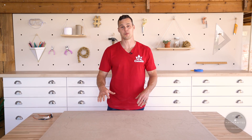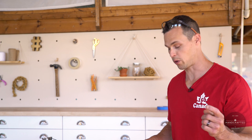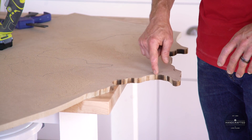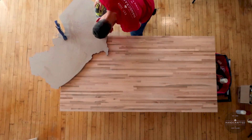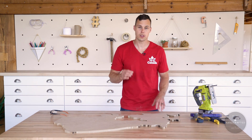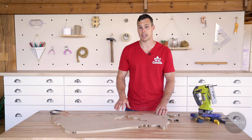Get your jigsaw and cut out your path. A little tip for everybody at home: when you're cutting with your jigsaw and you find yourself getting into those tight little narrow detail spots, because of these details being so intricate, it's hard to actually make that pass with the jigsaw in one swoop. What I'm going to recommend is that you come back to these afterwards and cut them out. I've got it all cut out now. Next step is obviously doing the fine filing around the edges. You can simply just go straight into painting and sanding and just get this thing ready to go.